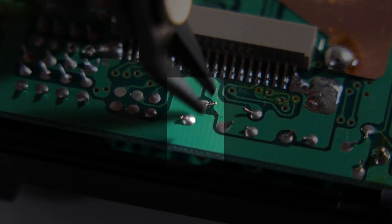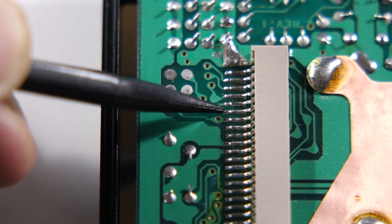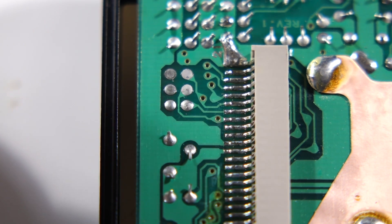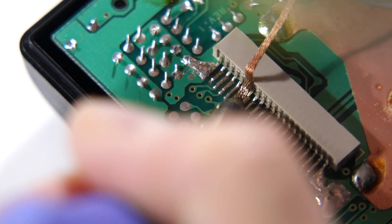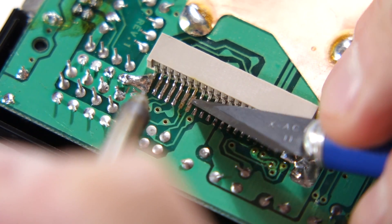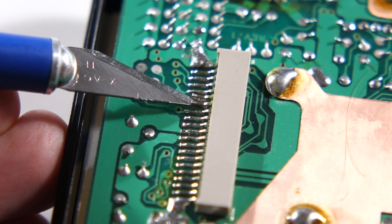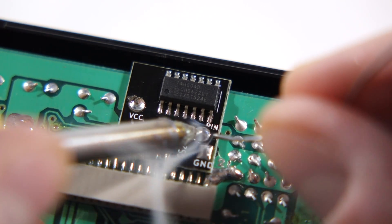This work gets done to the logic board on the back half of the console. To make a little more room for the module, use a pair of flush cutters to trim down the excess leads at these two solder points. The module solders to the ribbon cable connector, but before we can do that, we need to disconnect a couple pins. Counting from the right, they're the sixth and seventh pins — they have two traces that run next to each other. Use some fine desoldering braid to wick away the solder from the pins. Put it between them and you'll get both at the same time. What's so cool about the way the module was designed is it has holes directly over three of the connections we need to make.